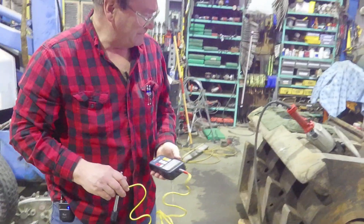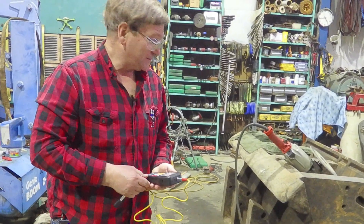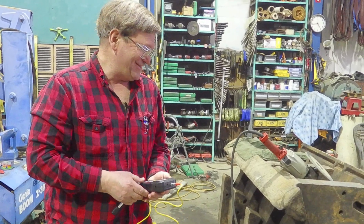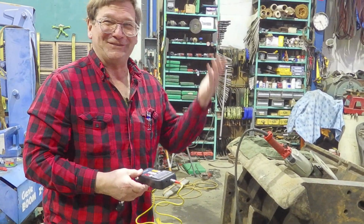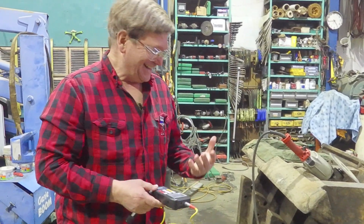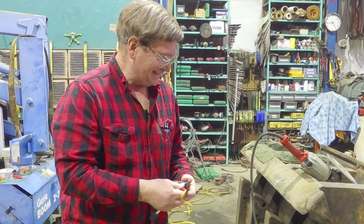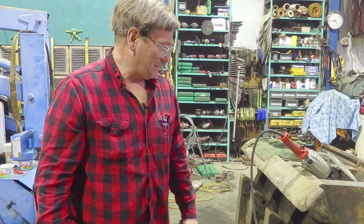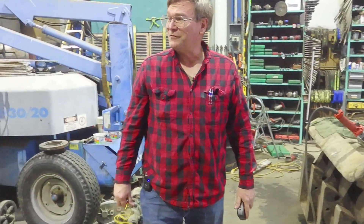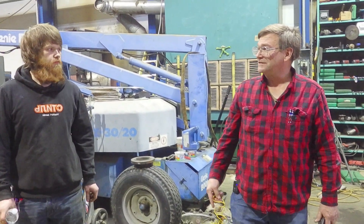She's got some toughness all the way through, even where it had been annealed by the bearing spinning against it — which it also could get hardened if they watered it down right after it quit spinning while it was on fire. You don't ever know for sure what happens with it. It's on the soft side of the 41-40 that's hardened.